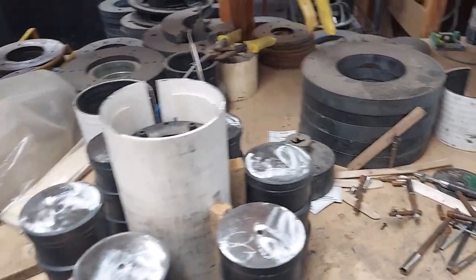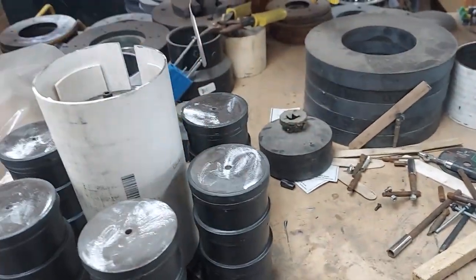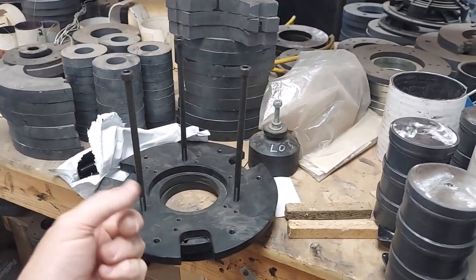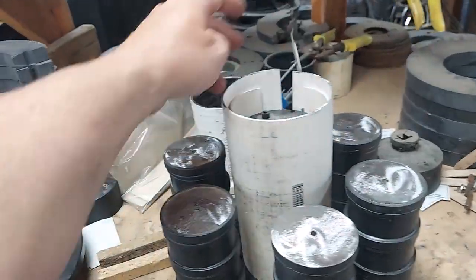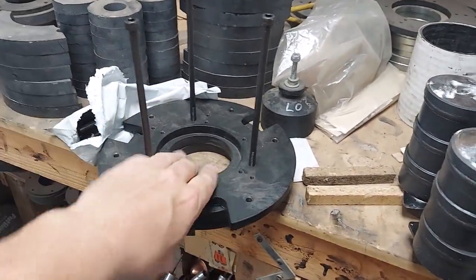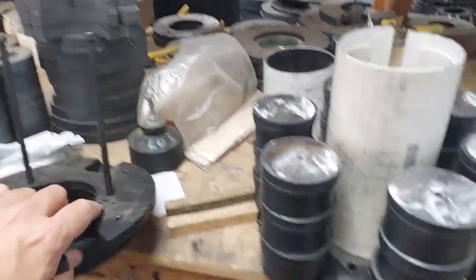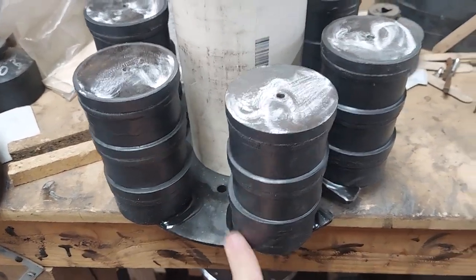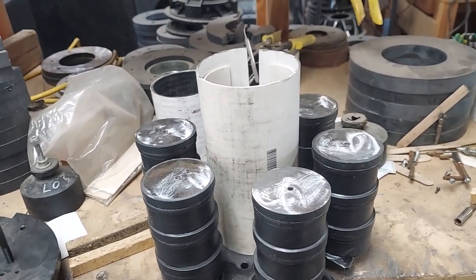It's just workspace — I've got too many projects going at once because everybody wants affordable woofers. I think these bolts are slightly long, which I got on purpose, and then I have to cut them down a little bit. I'll put epoxy on each one of these, then the bolt comes from the bottom up and fastens on the flip side of the top plate — just like that. Then I went back and coated all the exposed spots with a little bit of epoxy so they won't rust. It should last 20-30 years.